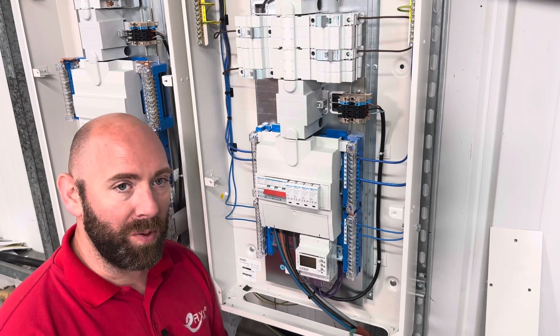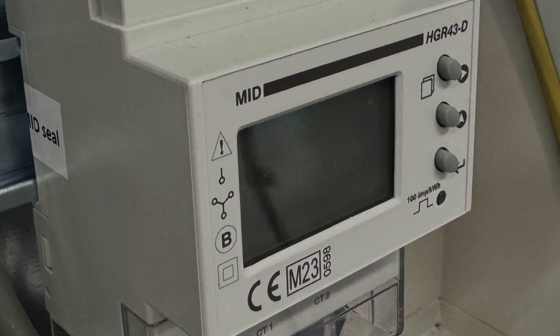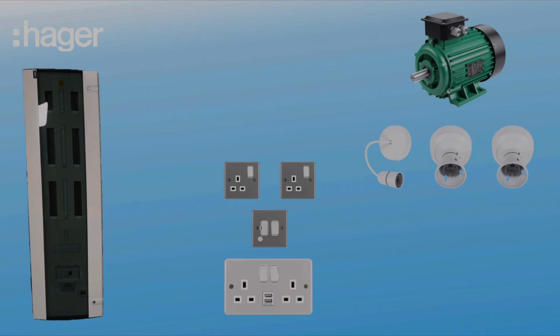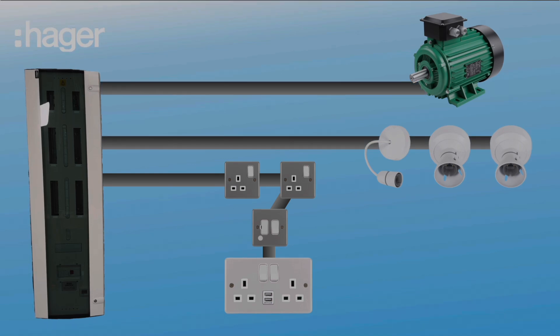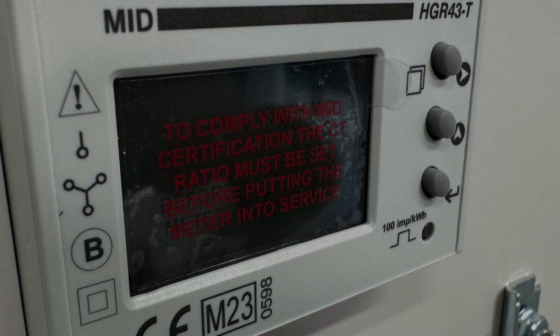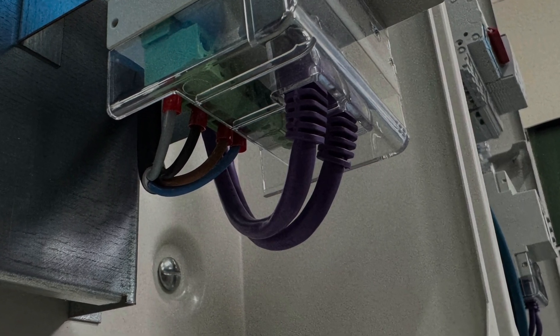So why are we excited about this board? It's down to this MID meter. To explain properly, I'm going to need a graphic. The MID in MID meter means it meets the Measuring Instruments Directive, so it meets the high standards required across that directive. Using the Modbus protocol I mentioned earlier, it collects data from each pan and allows the owner of the supply to actively monitor where the power is being used, and by what and by whom. First time I've seen a meter like this incorporated within a power and lighting board with its own Modbus connections to each of those pans.